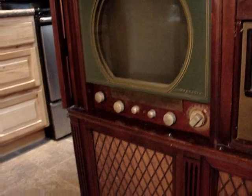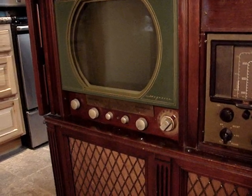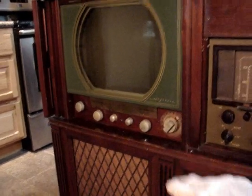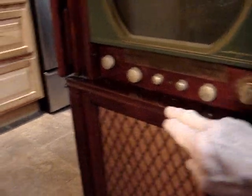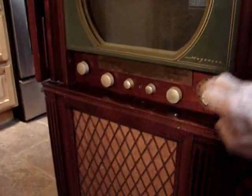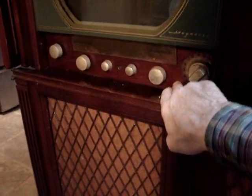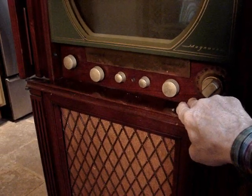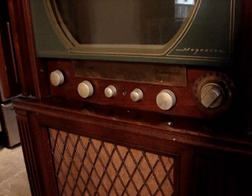I've investigated it, and in the back you can't take it out the back because one of the mounting studs of the changer is in the way. So I'd have to take the changer up and out to get it out the back. But I do believe this comes out the front because this comes apart. There's only two screws I think that hold this whole bezel assembly on, and this piece of wood has a couple screws underneath. So I think if I take the bezel up and out and take the screws that hold this piece of wood underneath out, it will slide out the front. But this is a weird screw — it's not a Phillips, it's got a special screw head.